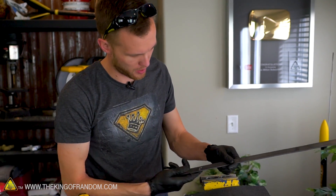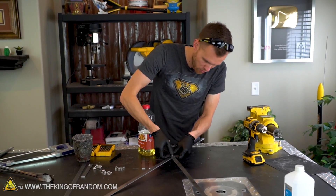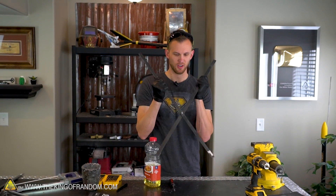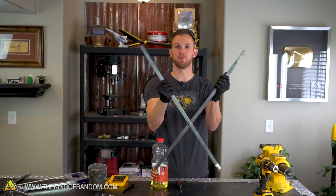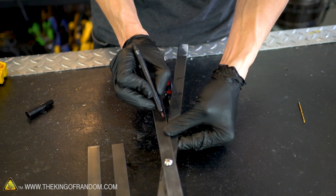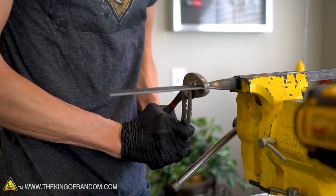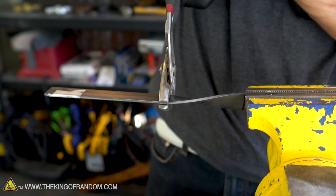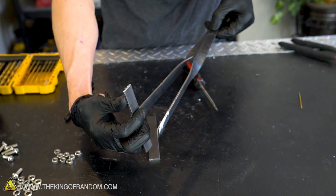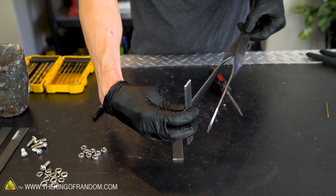There's just a little bit of a burr on the bottom of our steel, so let's take some sandpaper and get rid of that. As a quick test, if we fit our bolt through both of those, we've got ourselves a hinged pair — it's just two pieces of metal on a hinge, but making good progress. Let's see if we can't bend the ends of our steel 90 degrees so the flat portion will be facing the crucible. That's pretty good alignment. Now we need to add little claws onto both ends — first we need to add a little bit of curve into the bar, since it's straight right now, which is not going to be good for grabbing a crucible.